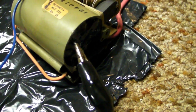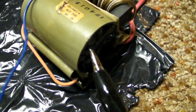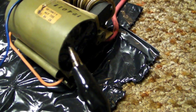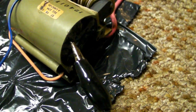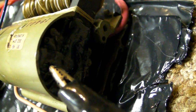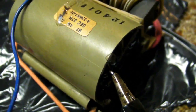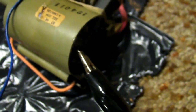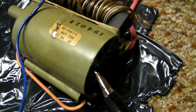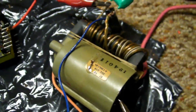Works really good. It does get warm when I'm pulling big arcs from it. Earlier today, it arced over from a few pins and burnt some plastic. So I hot glued the crap out of it, only keeping the pin I need. And then it was good. Then it arced to the core, so I glued around the core some, and it's been fine for now.